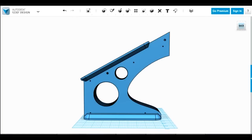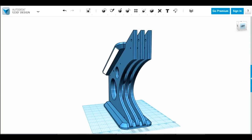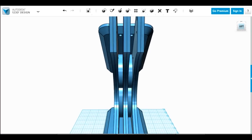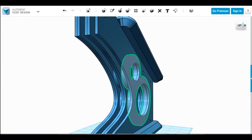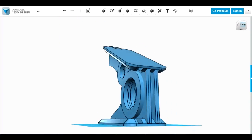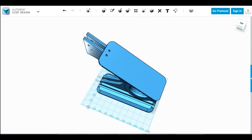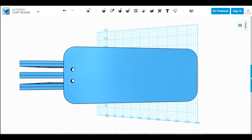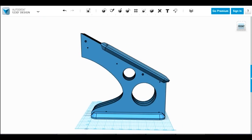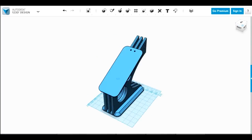This is the basic idea: a short lifter made of lots of 3D printed sections laminated together. I'm hoping I can print these at less than 100% solid — probably about 30%, the same as R2D2. It's got six 5mm layers with figure-of-8 sections in between, located into slots on a base and on the top where my foot goes. The top piece has two bolt holes to attach to the heel of a shoe on that platform, so it'll be slanted forward slightly. The pointy piece at the back will be the heel. There'll be more features added — conduit decoration, a big heel, and pointy toes at the front — but for now we're going to get this structure printed and see how strong it is.